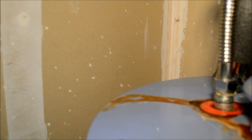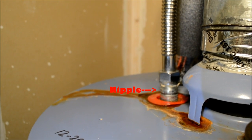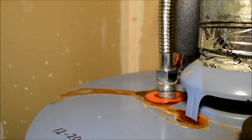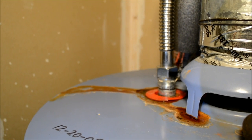I thought, water runs downhill, let's check out the top — and as I was looking I found this: the tank fitting is leaking. I immediately traced it up the line to see if the line was dry — it was dry, no problem there. I checked the fitting right here where it connects into the pipe nipple and that was good, so that only leaves the connection from the nipple into the tank.